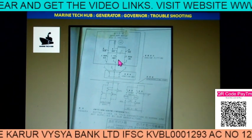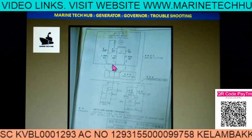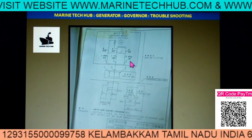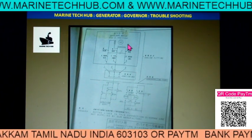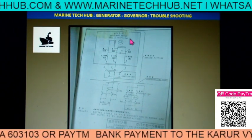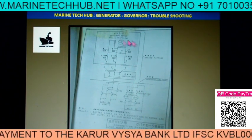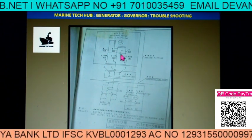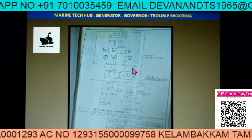Electrical officers, please make sure if you have such a problem, check the voltage coming to the motor and check whether the small motor is working properly — maybe it is not free, and then it will not be able to give the correct feedback to increase the load. This is one thing I was able to solve on board the ship and they were very happy. If you have a similar problem, check the voltage coming to the governor motor and make sure it is free. If you like the video, please subscribe and have a nice day. Thank you very much.